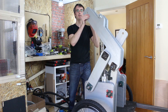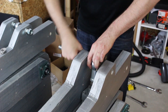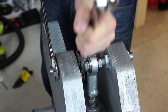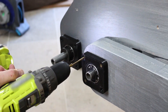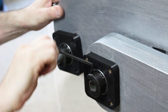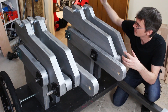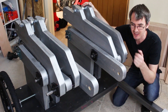Here's one leg together — just got to do the other one and we'll put some air in it. The mechanism of the legs is a bit like a weirdly angled scissor lift, and that means I only need one pneumatic cylinder in each leg, which will bring the body up eventually to exactly the right angle. Both legs are together, we've got a few more plates to hold pieces locked, and on the whole it's looking pretty robust. There's some 3D printed bearing blocks, but we can always upgrade those if they're not strong enough.